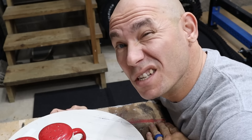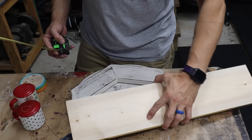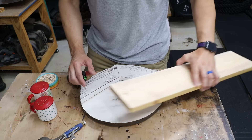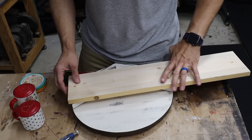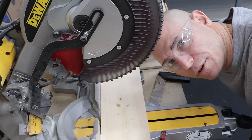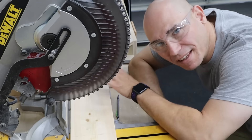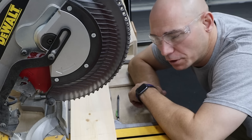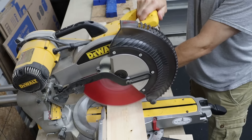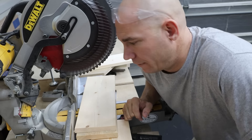That's a Lazy Susan — these are easy to make and you can sell them. If I was going to make another one, this is a one by six, just a common spruce one by six. This Lazy Susan is 14 inches in diameter, so the longest piece I'd need would be 14 inches and you're going to need three pieces. I'm going to come over to the miter saw, measure 14 inches, and this will be my center board. You can make these out of drops or buy a one by six and make a couple. I'm actually making one out of all scrap lumber.